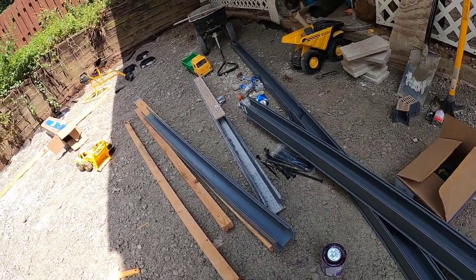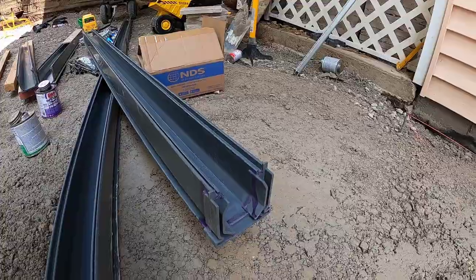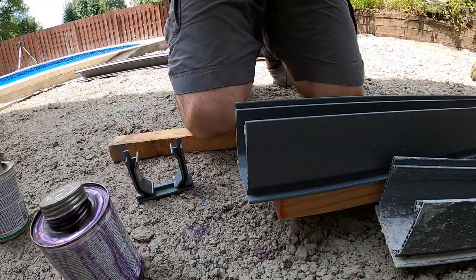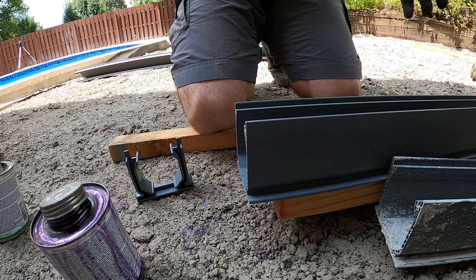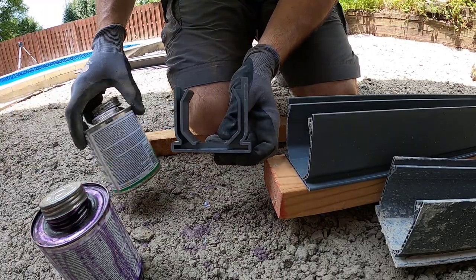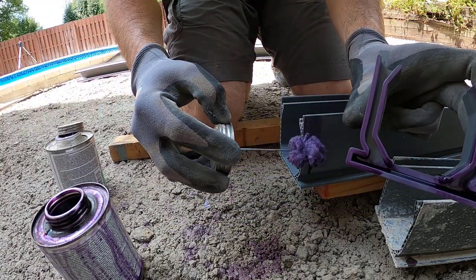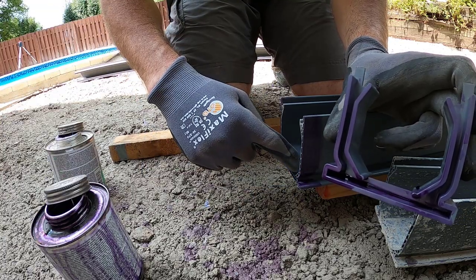First I'm going through and putting couplers on some of the sections so connecting them together goes faster. You just use PVC glue — I'm using primer and cement. It doesn't set up quite as quickly as schedule 40 PVC. I'll show you quickly on one piece: we've got the couplers, PVC primer, and PVC cement. It'd probably be better with a smaller dauber to get inside the channel well, but I'm making it work.